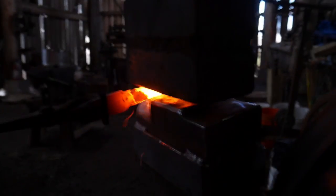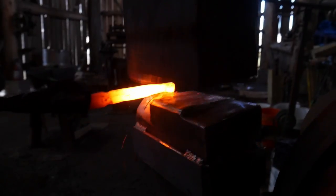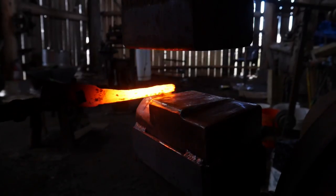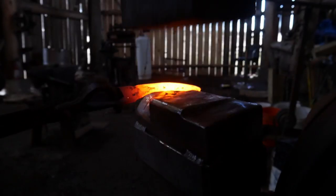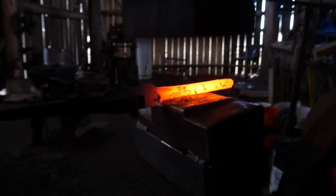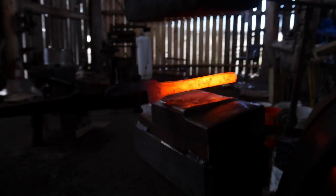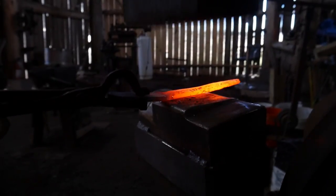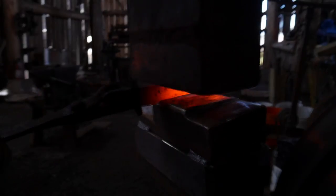Now usually I use flat dies on the power hammer and flat dies only, because most of the time when I use the power hammer I am making some sort of tooling of some kind. That's when I'm using it most. But in this case I was forging out some oak leaf curtain tiebacks. I've done a whole video on these before. You can search that up on the channel as well. It'll probably be linked down in the description.